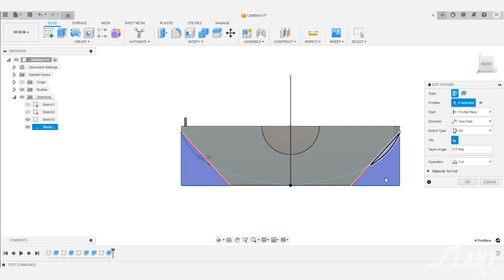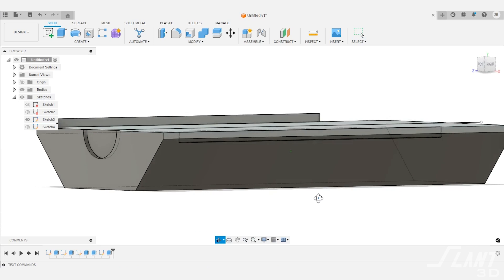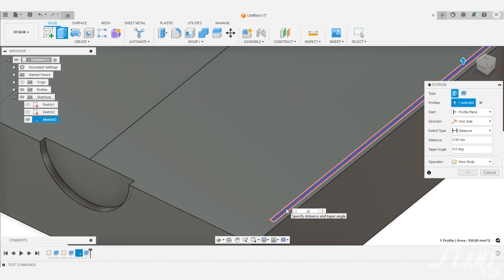So how did we actually do this? The design is set up to be made in two halves. This is one half of that white standard water bottle, optimized for mass production FDM printing. It prints on the head right here. Since it has a chamfered faceted design, you don't have to worry about side extrusion on the first layer — it comes off very clean with a minimum amount of surface contact. It has a groove and tongue so you can print two identical halves and press them together. Up top it's angled to avoid supports or overhangs.